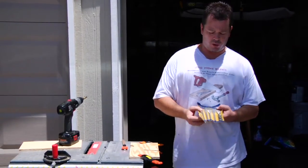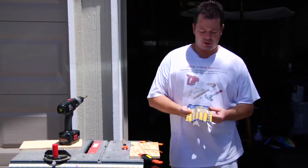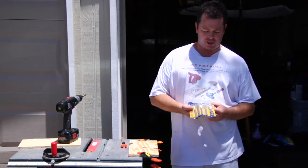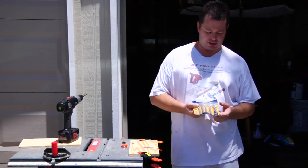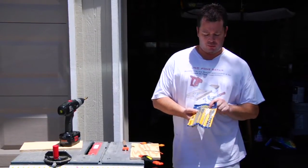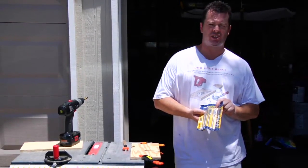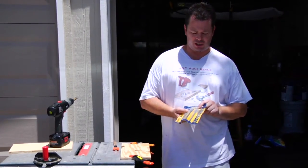This is a real quick and efficient way to drill a hole through different types of wood. I prefer these better than the hole saw type of bits. These will just chew right through it, and it's got the little point on it so you can actually pinpoint the center of the hole and it'll give you a perfect hole, and it does it real efficiently.